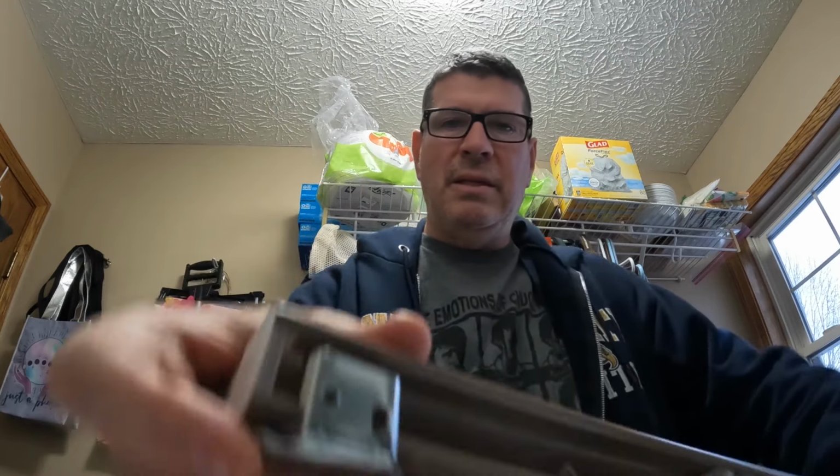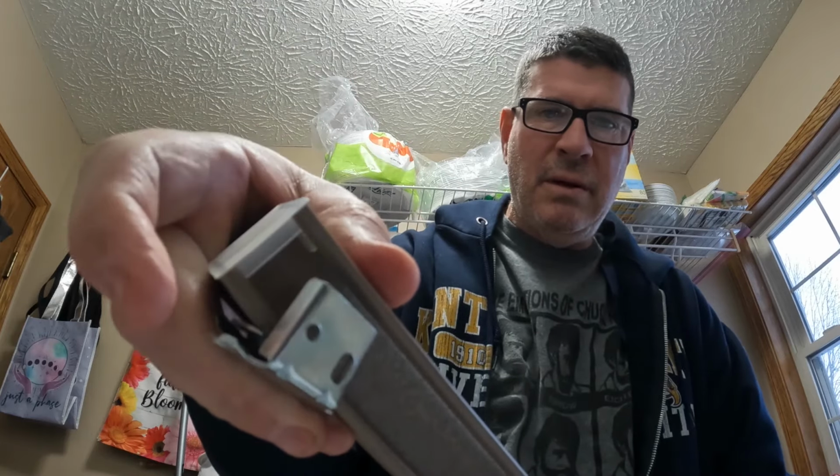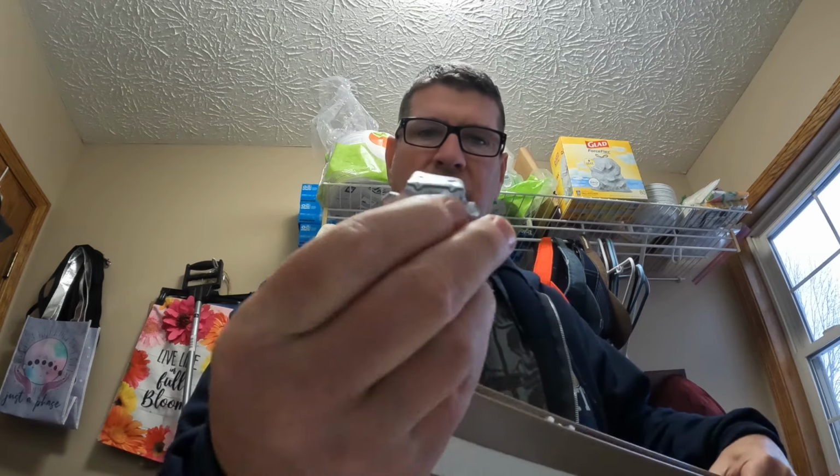First thing I want to point out is there's these plastic pieces on the end that actually slide inside here. They're just to protect the ends, but when you hang the brackets up, you got to reseat them inside the window frame far enough so they don't impede with the inside of these brackets. Looks like a half an inch, so these have to go in the window frame.